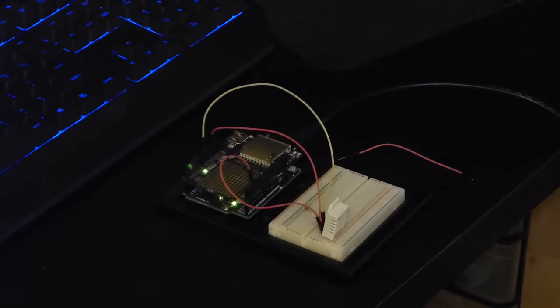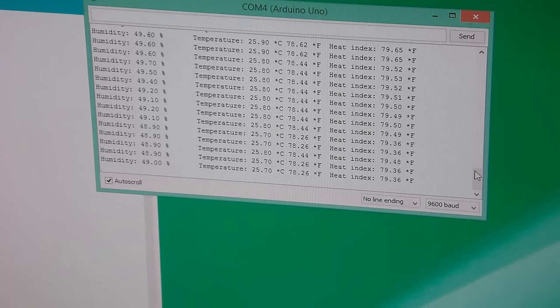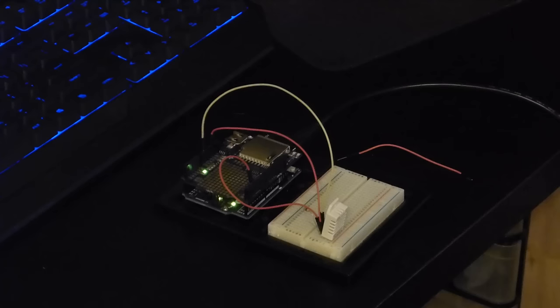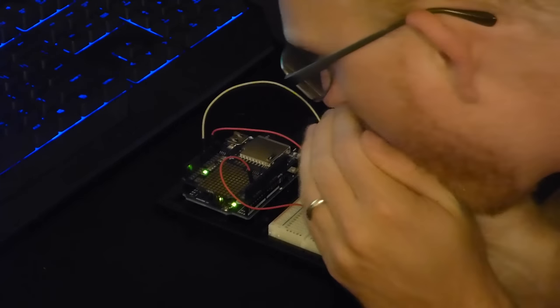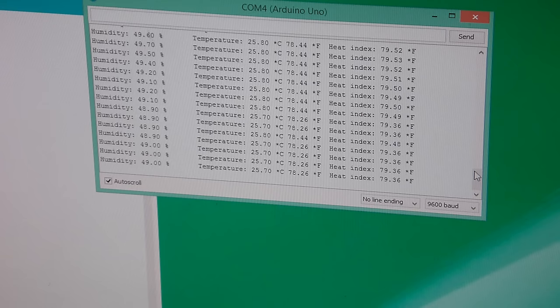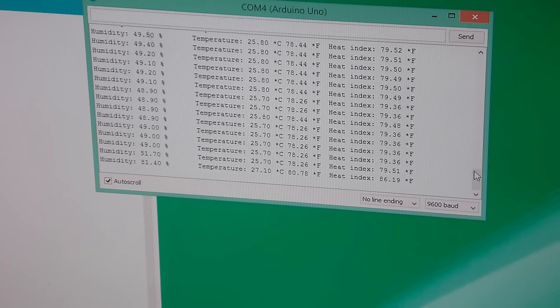Finally, I got the sensor which measures both air temperature and relative humidity. This is the only digital sensor I'm using. It's really easy to use since all the electronics are on board and the code is already written, so I just end up with nicely scaled readings. The problem with the digital sensor is that my multimeter can't talk to it, so if there's any need for troubleshooting, I don't really have a lot of options. Luckily, this one worked just fine.